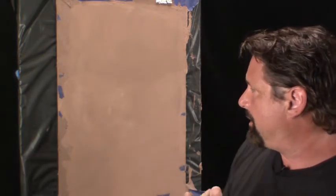I'm going to let this dry to about 90% — what I call the humid state. If I touch the plaster and it's still damp, I know there's moisture still inside. If it feels like just room temperature or hard as a rock, it won't have moisture in it. That means I can't compress or burnish it, and it's going to be much harder to blend in my lime paint. I want to put the lime paint on wet into wet — I want it to become part of the plaster, not just sit on top. You just kind of work it as you go, and over time you become more proficient and know exactly when it's the right time.